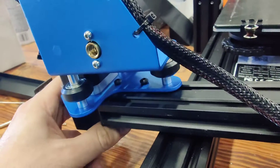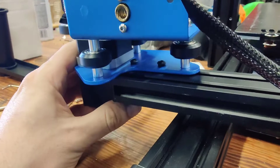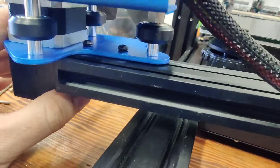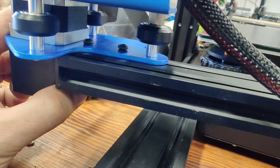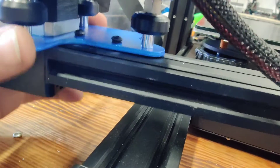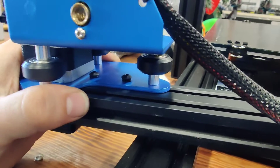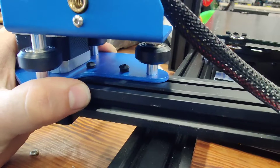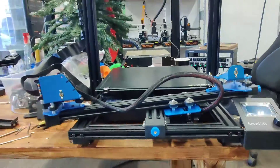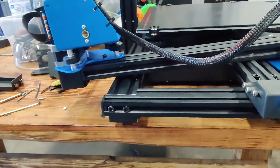On Enders they have a straight line that matches up with a reference mark, so you can align it that way. In this case I'm not exactly sure how to do it — maybe just get a feel for the center. That's literally the problem: when you need sub-one-millimeter accuracy and you're seeing three or four millimeters of play, that will bend the bar. When I got the bar level I could feel there was a bind — that's the issue.